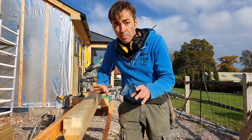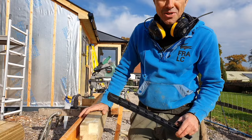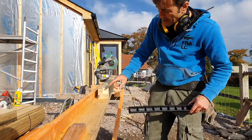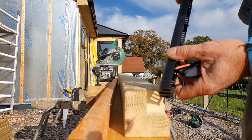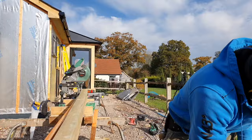I'm getting all the corner posts prepared and fixed before I start measuring my cladding in. At the bottom of the post I've cut out some relief, which clears our vent strip. The vent strip is also the support for the bottom piece of cladding, giving us the correct tilt as we go around. So I'm going to fix my battens on here and then fix the whole assembly up.